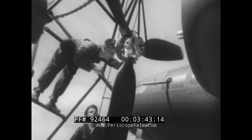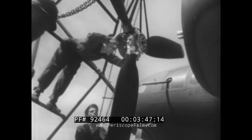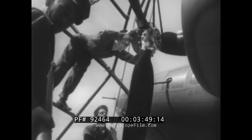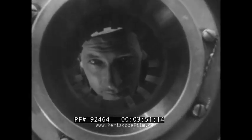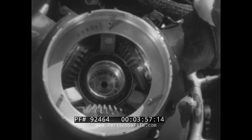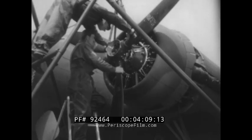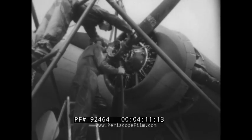Riding the hoist, Ott lines up the prop and the shaft. Pull her up — easy. Ott does a little peeking to see that everything is alright. Then the open spline in the prop hub is carefully pushed over the closed spline on the shaft. It doesn't pay to rush things though. Before the prop is seated, the anti-icer sprayer nozzle on the engine is checked. The slinger ring on the prop just clears this nozzle — if it doesn't, adjust it properly, or it can get curled up like a pretzel.